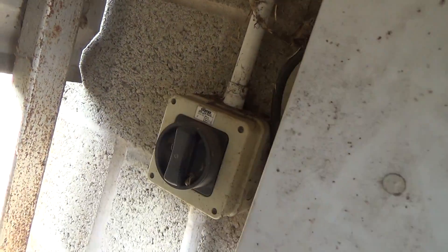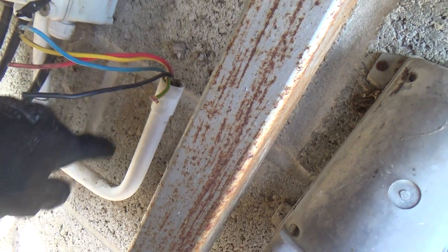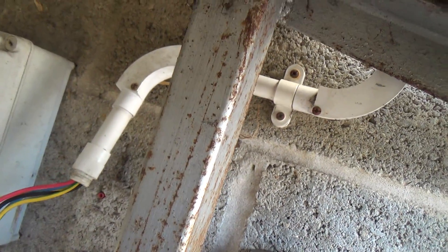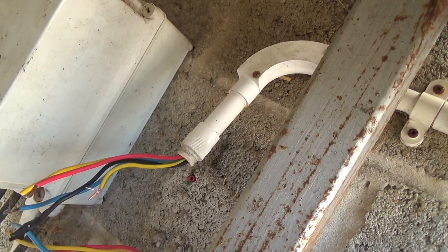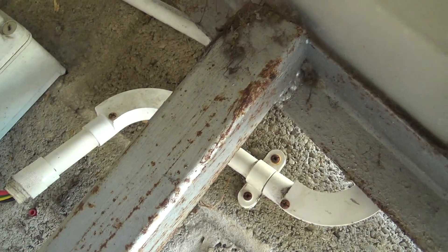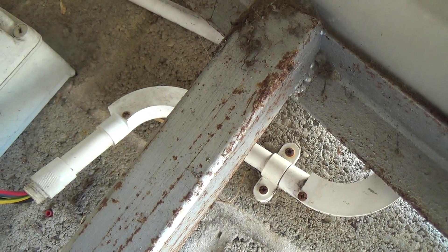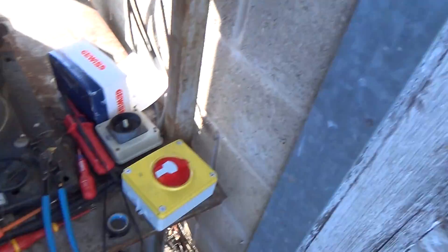That's where it's got to go, same as that one. We'll have to shorten one of these conduits. The rain has just got in the top because that's just anything that gets in there. He's getting the conduit here — it's not very good. I might bring a load of silicone in here; if I pop the cover off I could fill that up with silicone.